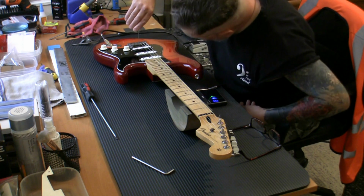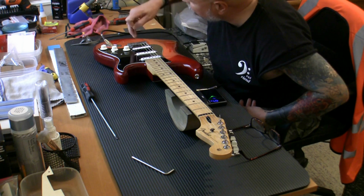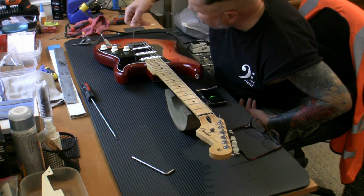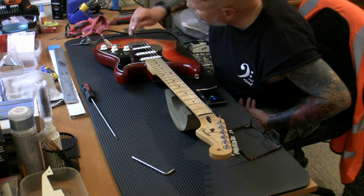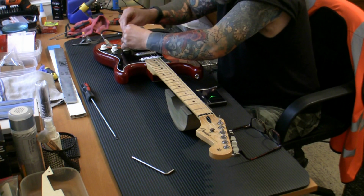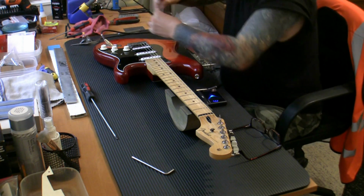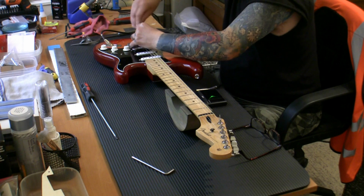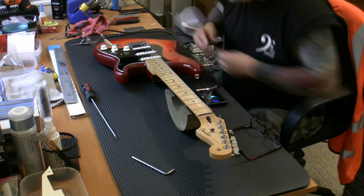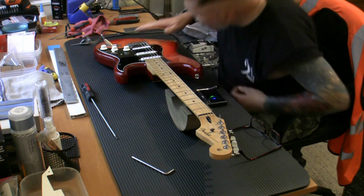And I'm just very slightly adjusting. So this one's high on one side, so we're going to bring it up a quarter of a turn and drop it down a quarter of a turn on the opposite side. And that's my level. And this one again, we're going to drop this about a 16th of a turn, bring it up a 16th of a turn on the opposite side. And these saddles are now all more or less horizontal. This is how they should be. And we should still be matching the radius. I will check it again, obviously. And that looks pretty good to me. Very tiny adjustments.